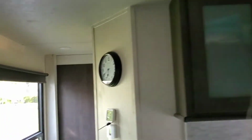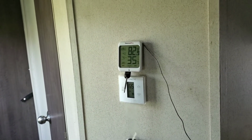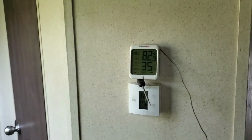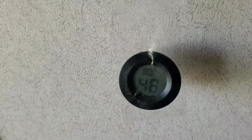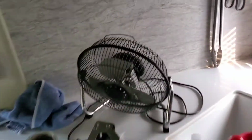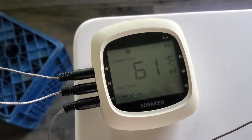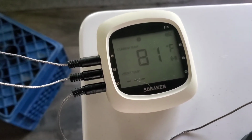Alright, YouTube, I think this is going to be my final installment for this video. We did get to 82 degrees. I'm sticking with that thermometer since I know we started at 102 on it, so I don't want to skew the results by mixing the other thermometer readings with it. But we dropped 20 degrees in 2 hours with that fan running, and we've got 81 degrees ambient temperature, 61 degrees cold supply air temperature. We are at that perfect 20 degree delta.